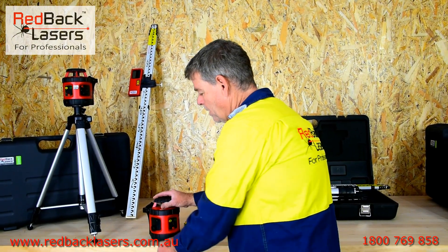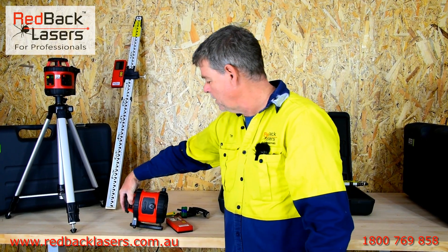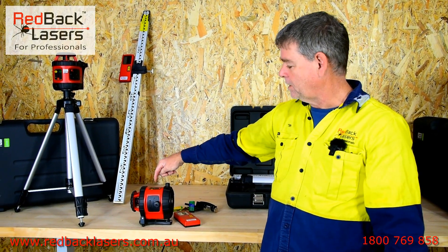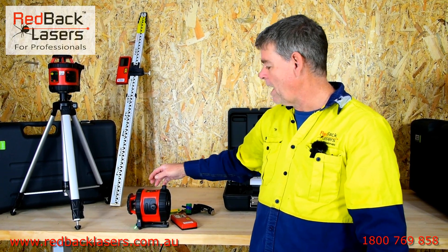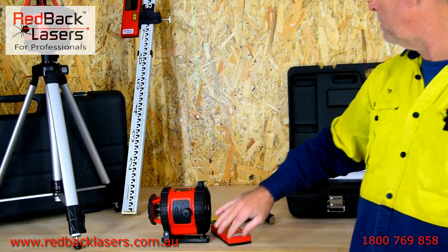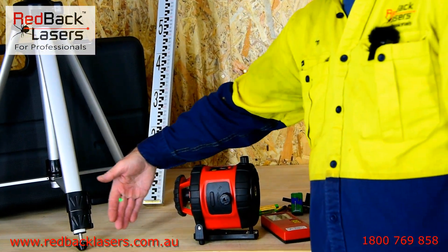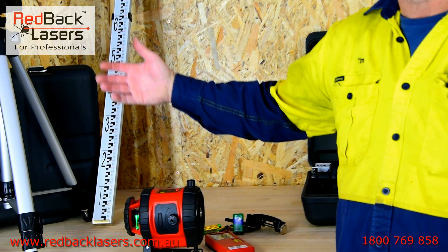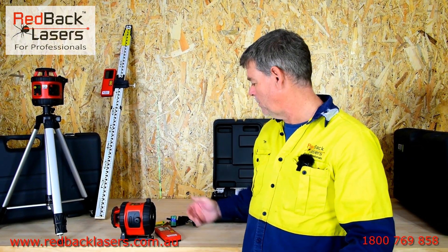If we lock the laser back off again we can mount it on its side — it's got the same tripod thread on the bottom. Manually adjusting to the spirit vial on the face of the laser we can get it vertical, power it on once it's level without unlocking the pendulum this time, and we can do all our vertical alignment. With the vertical plumb out the top we can even get a right angle, so we can do our sight square with that laser. Just adjust it up and away we go.